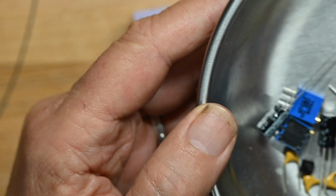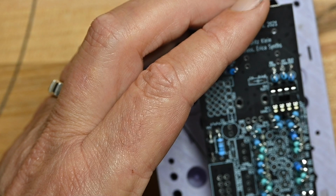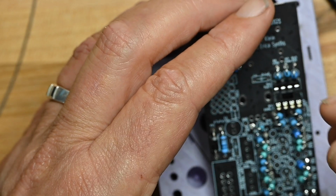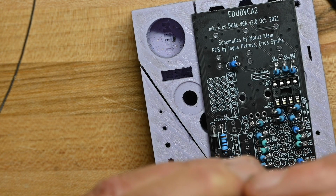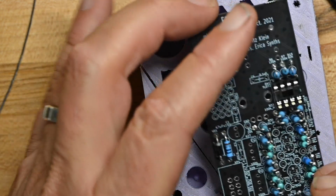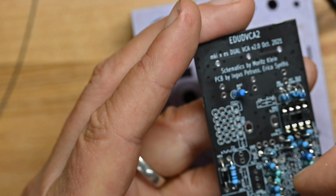Now we're going to do the transistors, and as I'm looking, there are 4 of them. They go 1, 2, 3, 4. And you can see the flat sides correspond to the flat side on the transistor, of course. And this board layout software has the middle lead, usually the gate, going forward. In other words, towards the flat side, where more typically the layout will be the middle leg goes towards the round side. However, it doesn't make any difference.